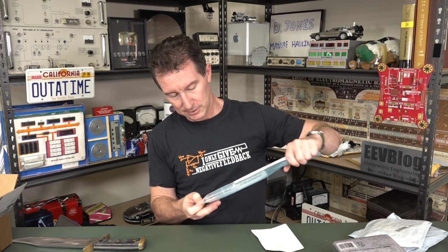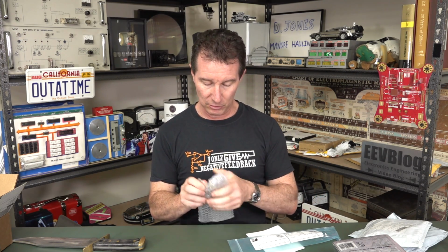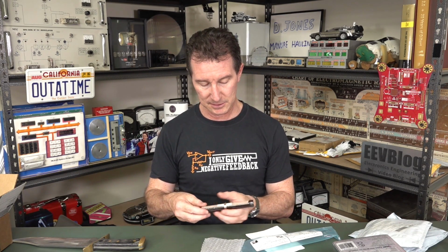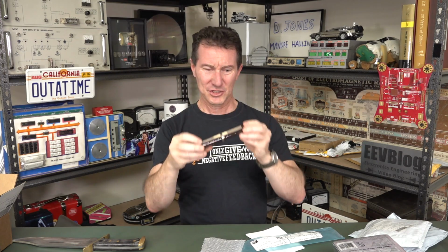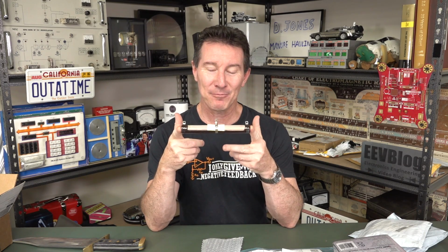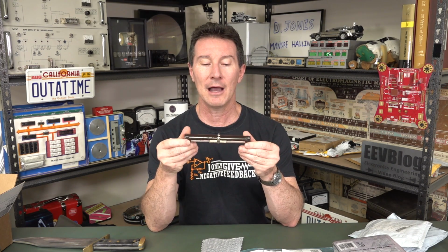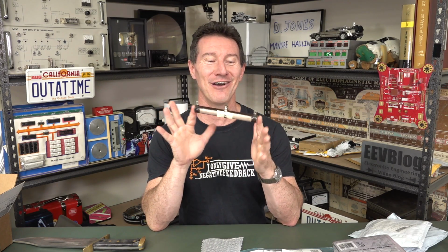Is it actually something from DigiKey? Oh, it is. I rather like the look of it. It's a very nice wire wound resistor. It's hollow, on a ceramic former. And why have I got a wire wound resistor? Oh, yes, of course, because this is just the DigiKey receipt, because I didn't have a high wattage one. This is a 100 watt 1K resistor suitable for testing Kev's Nixie tube high voltage 180 volt load thing. So he sent me the matching resistor. Nice, thanks, Kev.